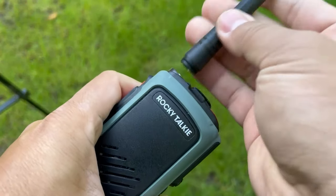You have dual channel capabilities — an A and B channel — so you can be on two different channels at once, plus a removable antenna. The benefit is you can have the whole expedition crew on one channel and another channel for maybe the person in front and back so you're not getting chatter. When somebody responds to you on the B channel, you have about five seconds to respond and it will go directly to them. If you don't, it'll default back to A, so you'll always be set on the A channel for talking, but you can flip manually. It's a nice feature to be able to respond directly to the B channel.